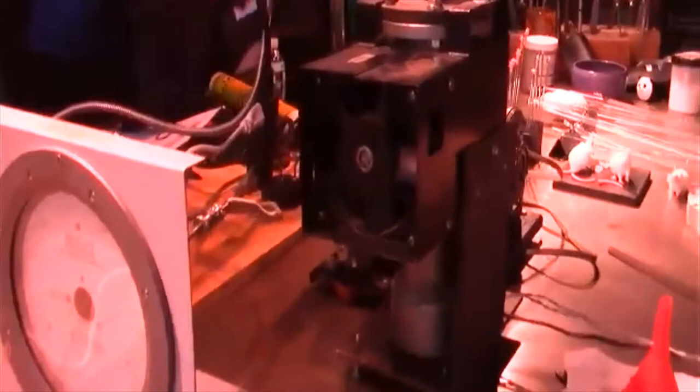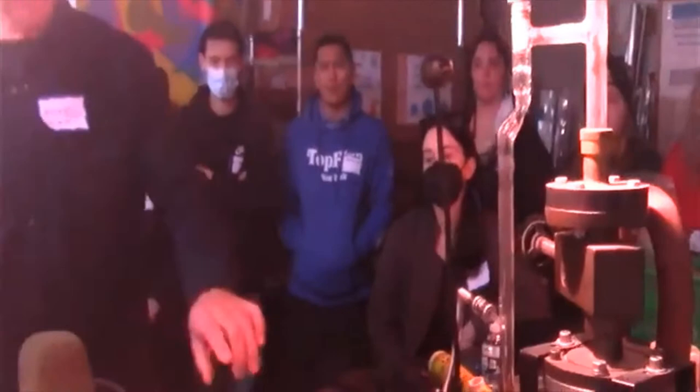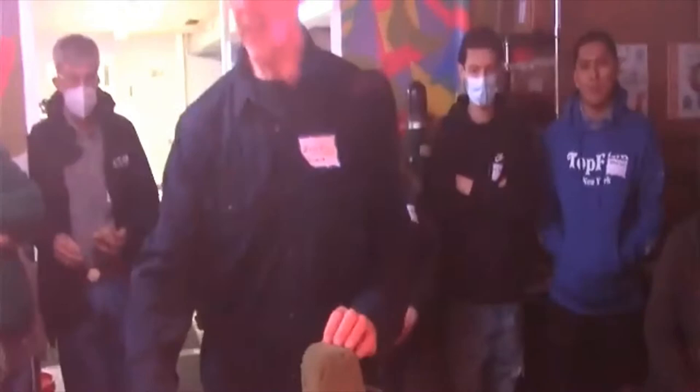Originally I thought I could use this tiny little vacuum pump that Dave had - it's like a $59 Harbor Freight one, but that was a little bit too small. So this is about the smallest, cheapest vacuum pump you need. You can buy these online for about a hundred bucks. It's providing the vacuum, but you don't have to have a high vacuum system like all the techs say. All you have to do is get below the final filling pressure - that's all you need.